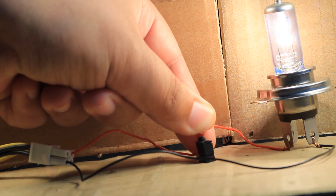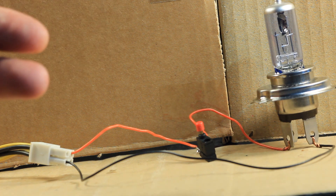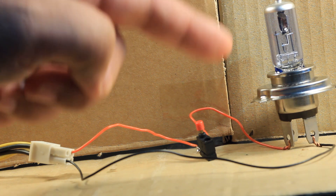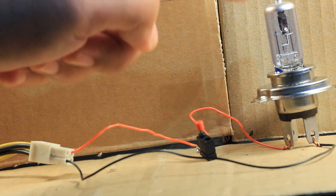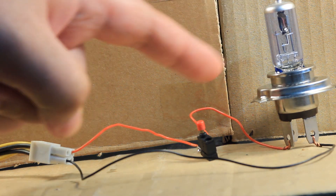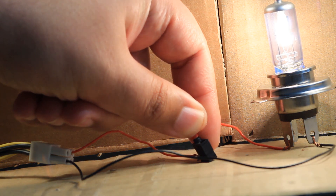Now when I release this push button, the light obviously goes off. You may ask what was the point of this experiment — it was really simple. However, if we pay a little more close attention, you might notice that after I push down the button, the light does not come on with full brightness right away. Also when I release the button, it takes a little bit of time for the filament to cool down, so it still emits light even after I have released the button and there is no power going through the circuit. I'm going to repeat the experiment — pay close attention to the filament and the switch. After I push it down, it takes a fraction of a second to fully heat up.